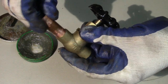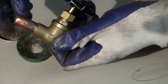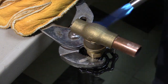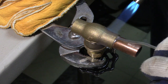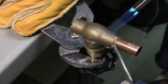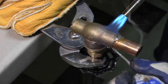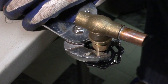Before you start to solder, don't forget to open up your valve — this will help dissipate the heat and gases in the valve. Now proceed to solder the two pieces together. I concentrate the heat on the shut off valve and not the tube, and because the solder will be attracted to the heat, it will automatically go inside to create the seal. And there we go — it's not pretty but it works for me.